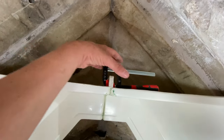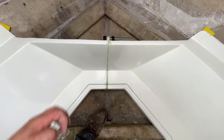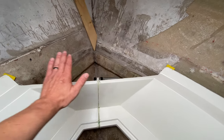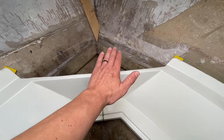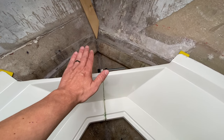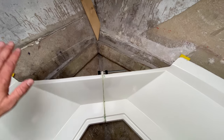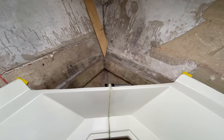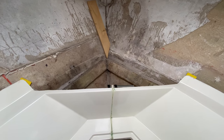so that we can make a bridge on that vertical support, so it'll run all the way through, and then that'll all get bonded together. We'll glass it and then glass the top of this as well, sort of 4 or 5 layers of glass on the bottom of the chain locker, maybe more, and then we'll come in and flow coat it, so that'll make it nice and watertight. And that's pretty much how the factory boat would have been done.